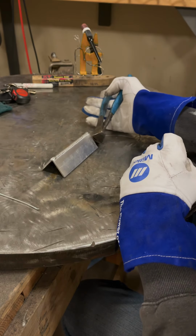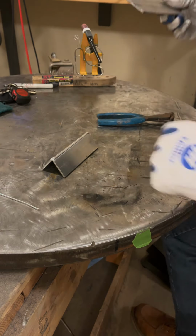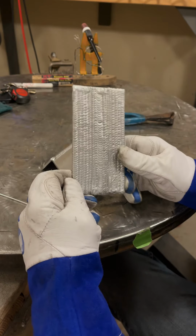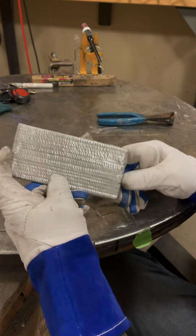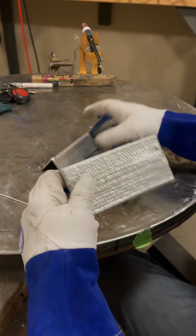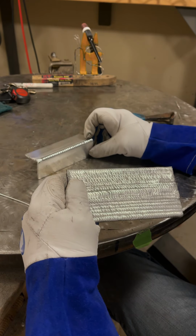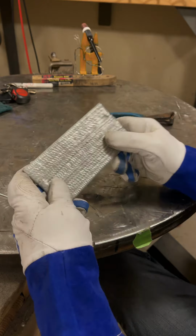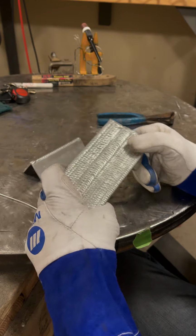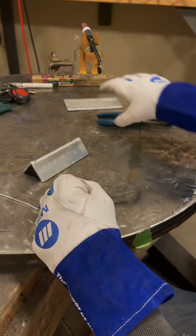And I actually shot a video where I welded just a flat plate, full length welds, bead on bead on bead. If you can do this, you can do this, okay? Doing a lot of outside corner joints, of course, you're gonna get better at it, but this is a lot cheaper and honestly a lot more effective at learning how to control the aluminum puddle than it is just doing outside corner welds or lap welds.